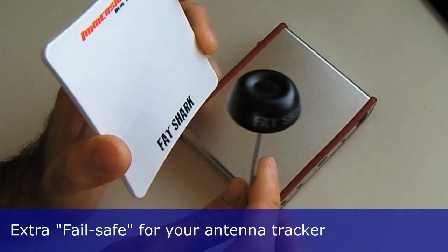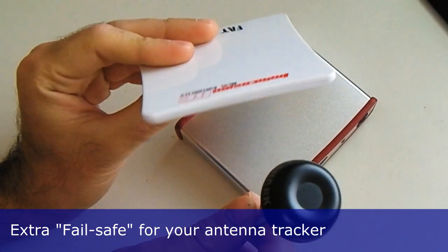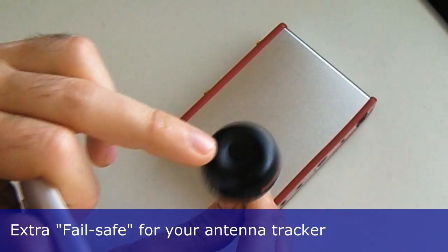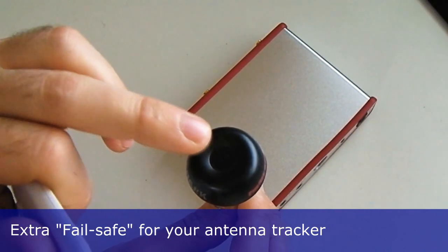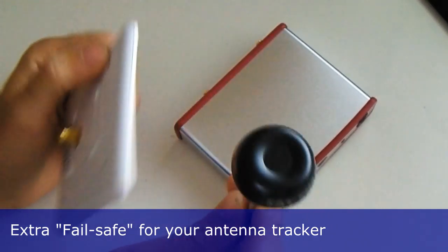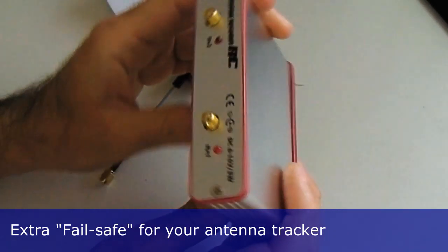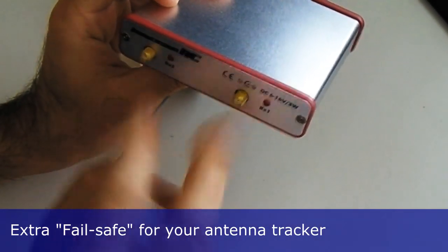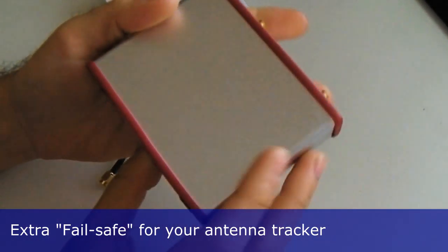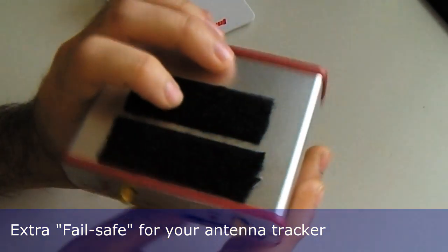You can use it as a backup, and a lot of these antenna trackers aren't 360 degrees and aren't very good at seeing if your plane is above you — so you're always going to get a signal through the top of your skew, even though it's not the best area to receive from. It's better than a patch antenna pointing in completely the wrong direction. So as you can see — two receivers in one, automatically switching between the best signal. I hope I've helped somebody understand why these things are so great!